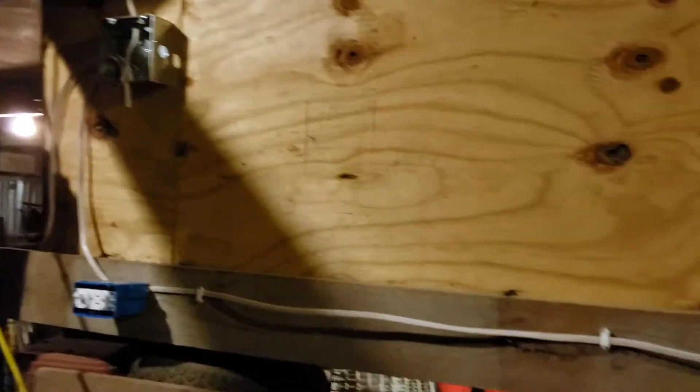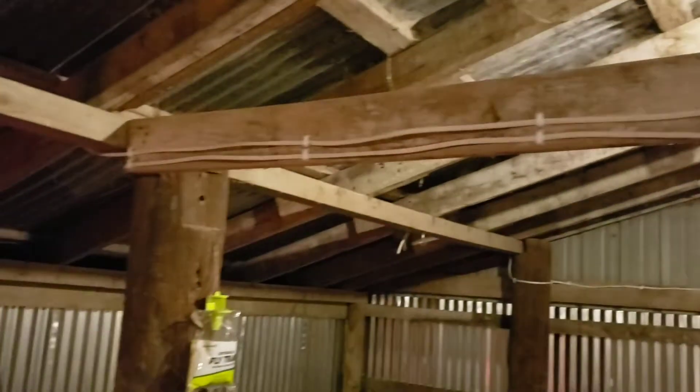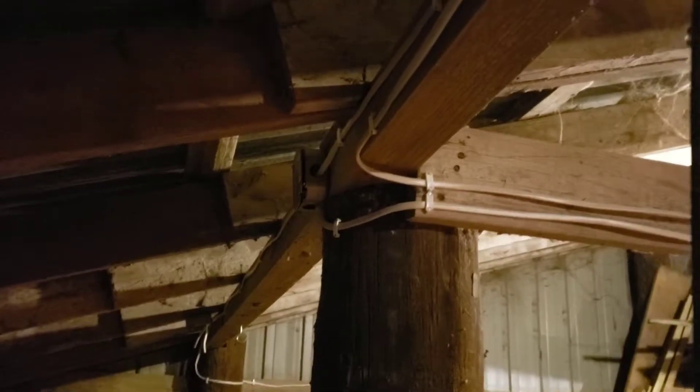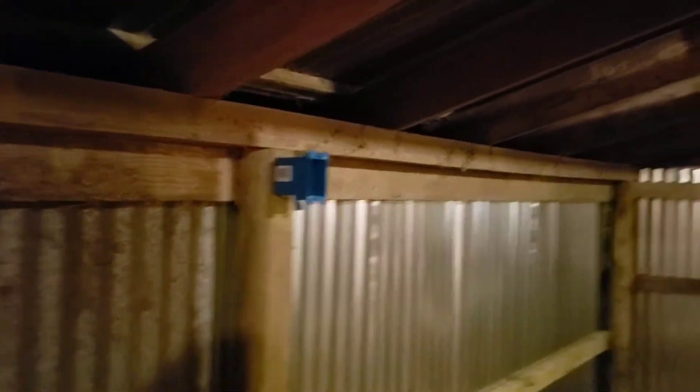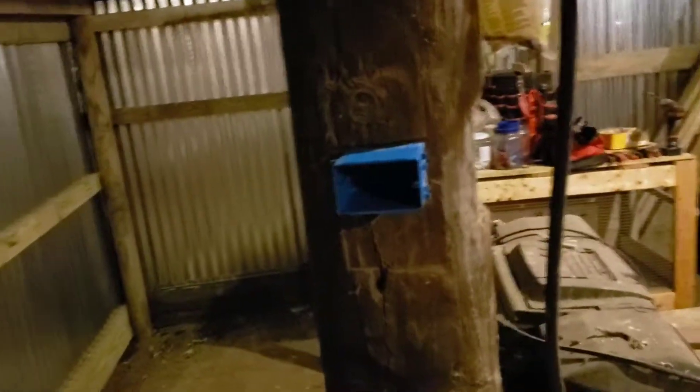Not exactly sure where I stopped recording because my battery died, but let me show you where I'm at tonight. I've got my junction box done, with wiring going up and around and over for my light and power. I've got a junction box that goes to each of my lights, and I have my power going up and around as one of my lights. I still need to run another wire that goes up and around, jumping off my switches. That's going to be an outlet slash junction box, which feeds back around to the next one, and then they'll go back around.